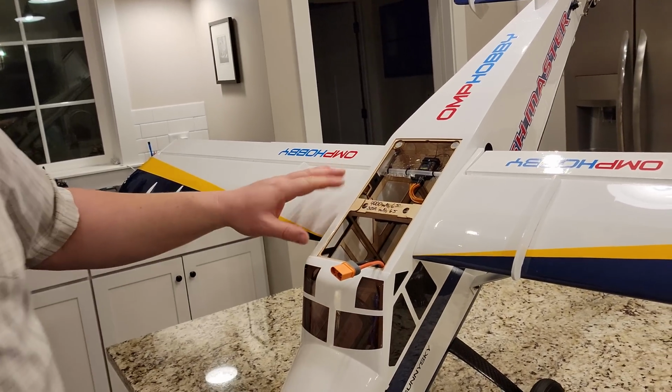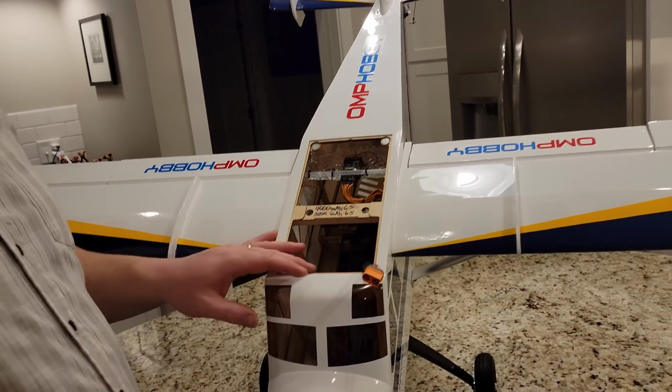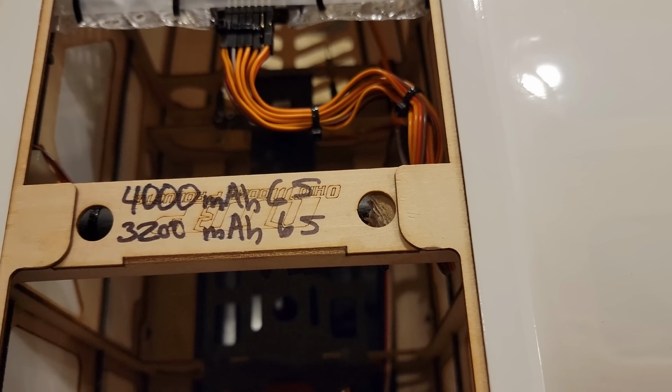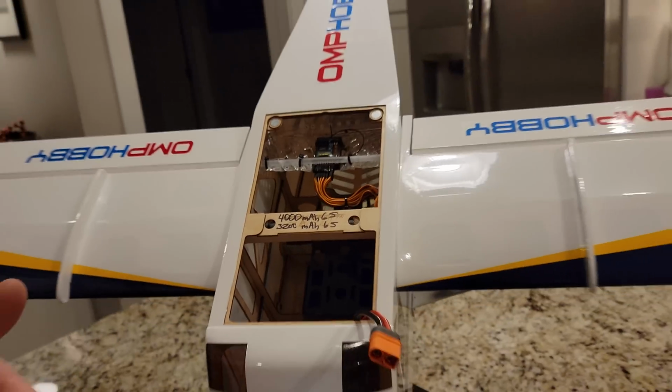If you ever break something like that, use wood glue if you can first, and I just have it shimmed up with some cardboard to hold it tight rather than putting a clamp in here because the clamp is gonna be in my way. I just have to remember to pull out the little cardboard there. Okay, so if you ever have an opportunity, I mean, CA is fine to fix stuff like that, but you wanna use wood glue where you can. Wood glue is stronger. It's just sort of unusual.